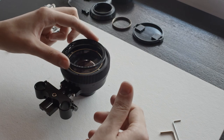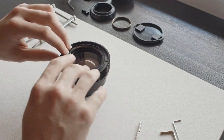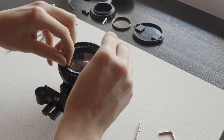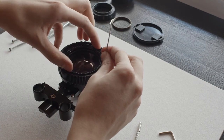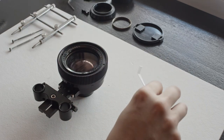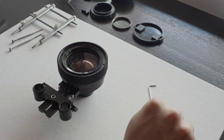After sanding, drop the nameplate inside and very gently start screwing it in. This can take a lot of time — based on feedback from other clients it's very easy to cross-thread. Take your time and spend a good five, ten, or even fifteen minutes sanding, test-fitting, and screwing. This is essentially the last step, with one optional non-mandatory step remaining: getting the rear housing back on.